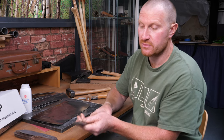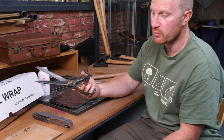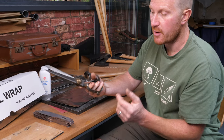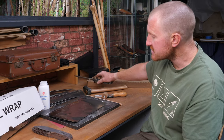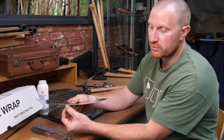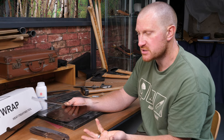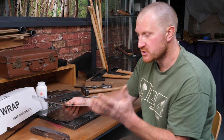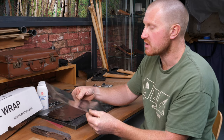When cutting this foil, I've found the easiest way is with some big shears - really old dressmaker's scissors from a car boot sale that I've sharpened up, which cut the foil really nicely. You could use tin snips, but because the foil is so thin and flexible you've got to be really careful because it will cut you. I find gloves a bit awkward so I just prepare myself for a few little nicks.